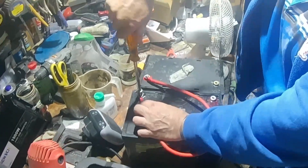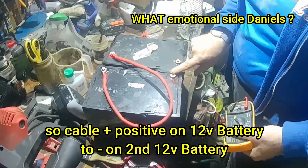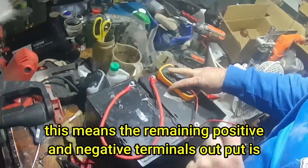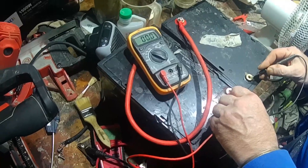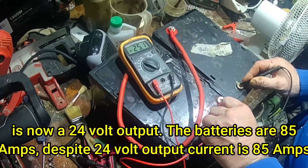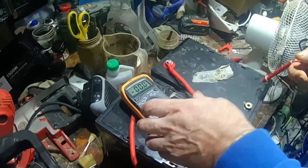This is the next terminal side coming out. So we've got plus there, minus there — 24 volts. I'm just doing this for my narration. And we set that there, put the red there, black on there. There we go — 25.14 volts. That makes sense: 12.7 plus 12.5.